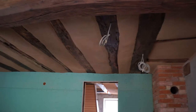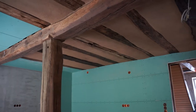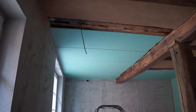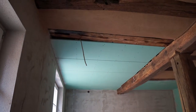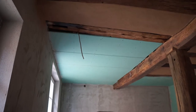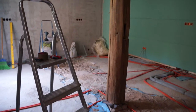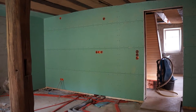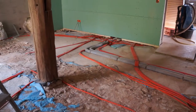A cable comes down here and then these LED rails going across the hallway so we can position little spotlights — and also directly above here where I've put up the plasterboard ceiling, just yesterday. I changed my mind on how the lighting might work there, so I installed an extra bit of cabling so we can put in spotlights directly over the door, which will also help light the island that will be just behind this beam. Finally the walls are completely covered with plasterboard and all the sockets are in.